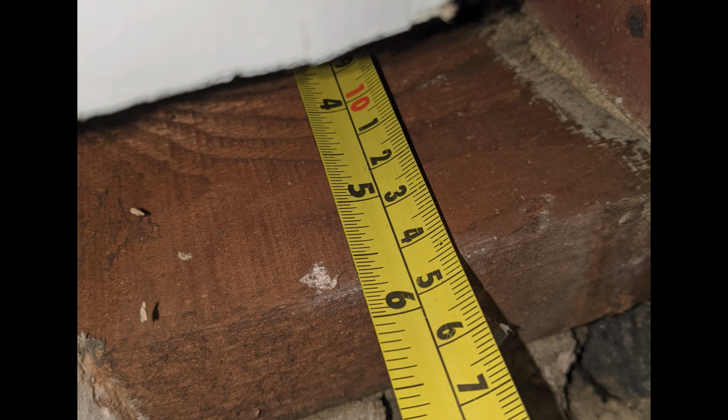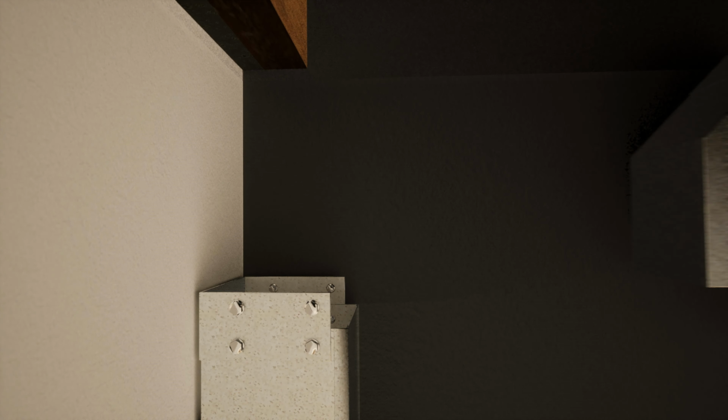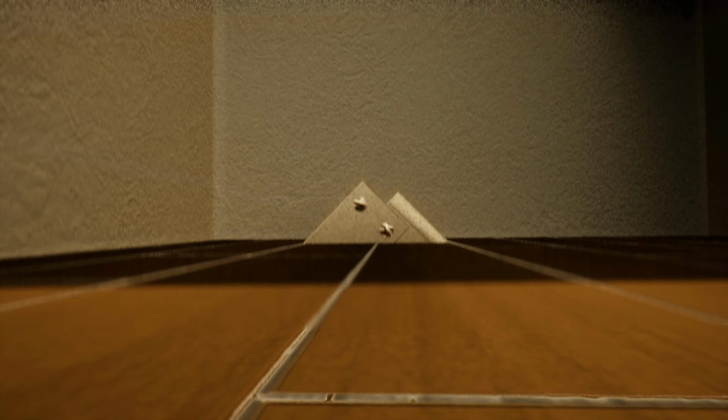But this required more planning. I took a bunch of measurements and 3D modeled the situation to look at my options. I can make a small bump in the trunking just using 4 45-degree bends to make 2 offsets without having to add a straight section in the middle.